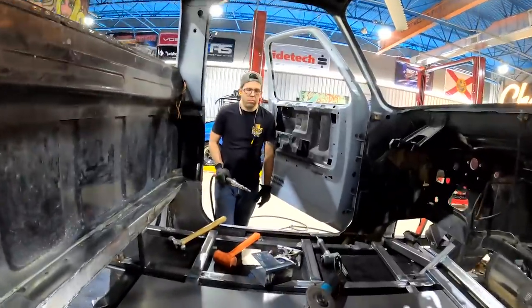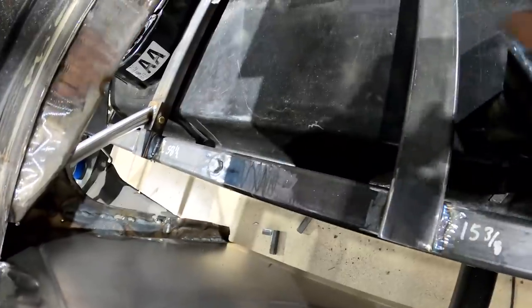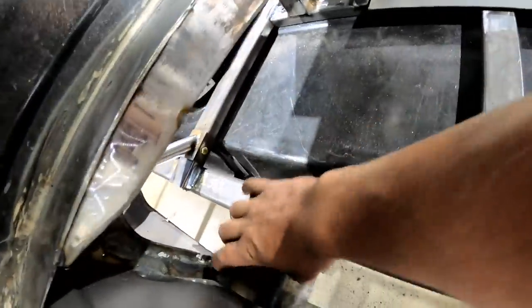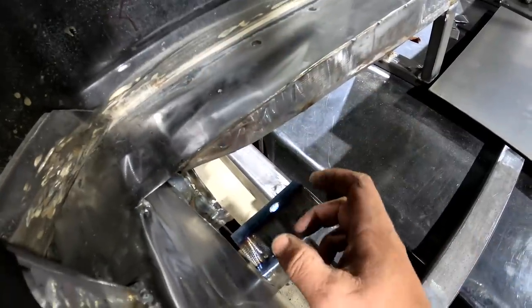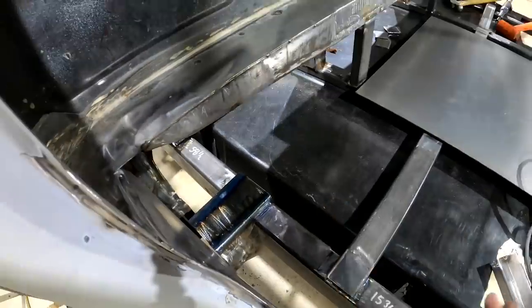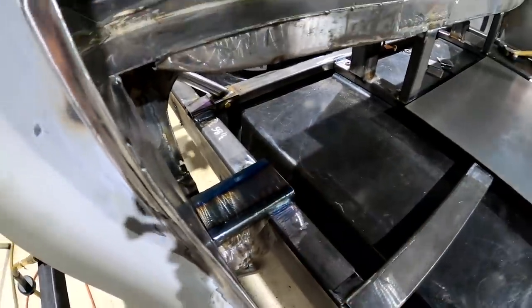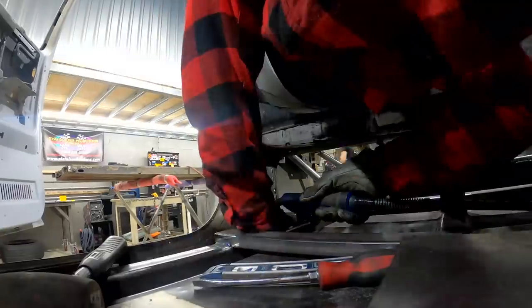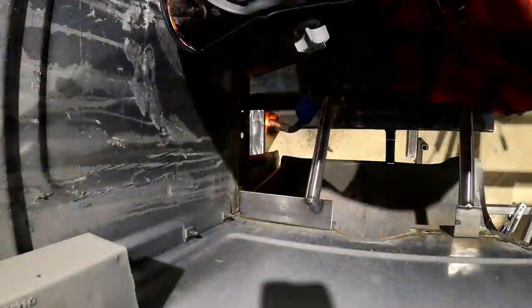Timmy is an absolute champion, he's been helping me clean up all the insides over here. Those brackets that I made are going to come in here - bingo blango - on the frame. I'm going to square it all up and then weld this whole thing into the frame, and this is going to be our outrigger for the cage. The cage is actually going to come straight down here, welded in, and then from there we'll make some filler pieces - welded twice through the support and then through here - so we tie everything together, then we'll do some cross bracing. God forbid stuff does happen and we have a race and that thing rolls over - all that pressure from the cage is going to come straight down to the frame, the strongest part of the car, to help protect whoever's racing it. Now that we've got the outriggers welded in, we can move on to project two for the day.